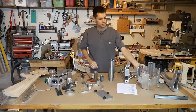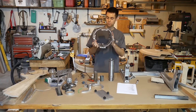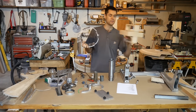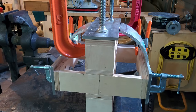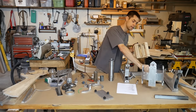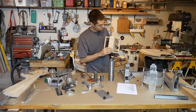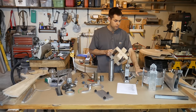When it came time to weld this hub together, you can't just sit there and cross your fingers and hope that it comes out in a nice octagon — you need a jig. So I made this jig out of wood and it worked pretty well. You might think wood isn't good for welding metal because it'll catch fire. Well, aluminum conducts heat pretty well. I used my brain a certain amount — I did not get it roasting hot, I had some washers spacing it out. It did start smoking a bit, but it held up fine and I got very good results.